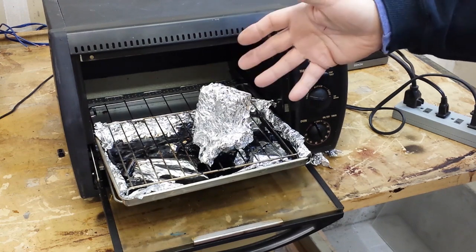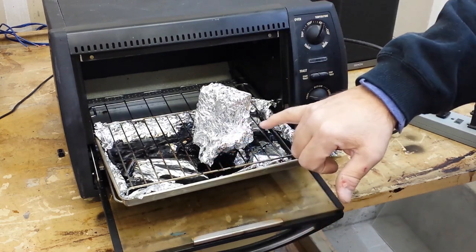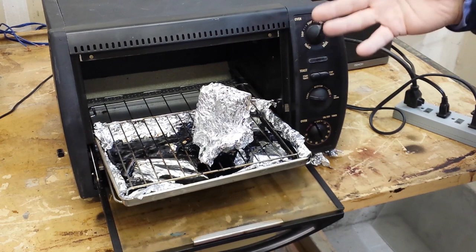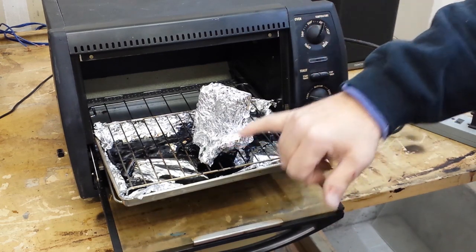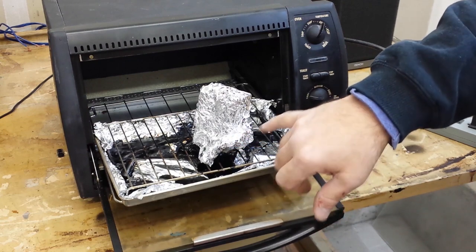We're going to bake this and get all the tar out of this thing. This is how I get the tar out of these — none of this playing with a heat gun for me, or freezing it, or any of that garbage. I wrap it with aluminum foil because that will keep the heating element from scorching the paint on this. It won't cool it off, but it will keep it from scorching if they're painted. I also protect the wires for the same reason — I'm replacing these wires anyway, but I want to keep them from scorching so I can see the color.